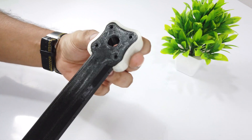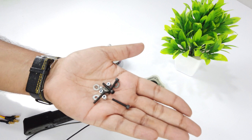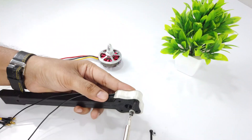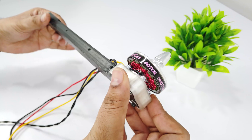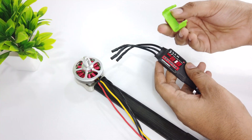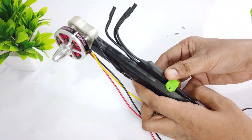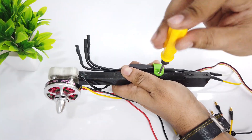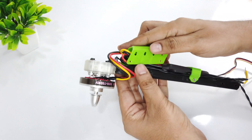Here is a look of it. I will be using these 5010 750kV disc motors and attach them using M3 bolts. I have used these motors as they provide good thrust for a 12-inch propeller and are also economic. Here is a 60-ampere ESC. Let's attach it using its mount. Although the peak current consumption of these motors is 30 amperes, using a higher ampere ESC reduces the chances of steps skipping. Wire holders hold the wire in place.